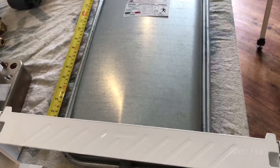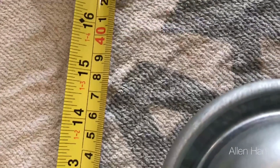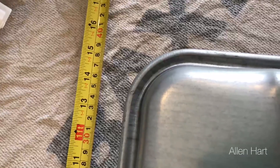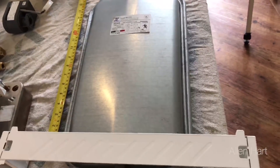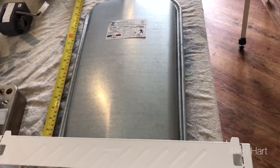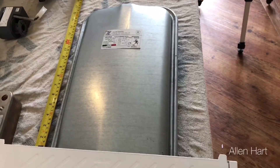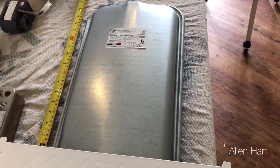To take the expansion vessel out on this boiler you will probably need to take the boiler off the wall. If the flue goes sidewards you need about 370mm of space so you can pull that expansion vessel out of the top. I believe this is an 8 litre expansion vessel, so it may be that you need to fit a bigger expansion vessel anyway.